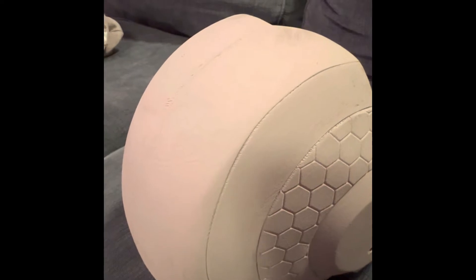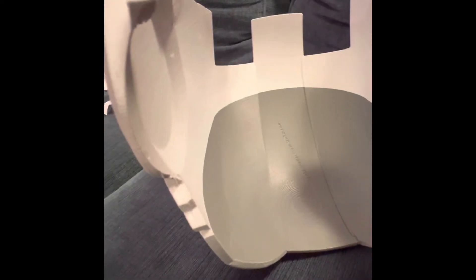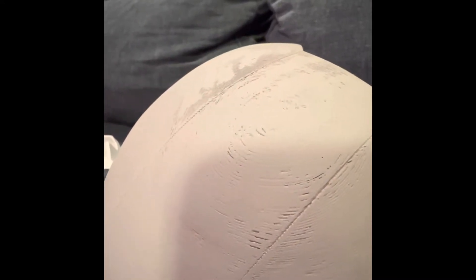So as of now, I haven't actually made a whole lot of progress. I have the dome printed right now — the top of the head. I've started the process of sanding and priming it, but you can see I have a lot, a lot of layer lines left. That's because I printed it upside down, so all those supports did not make it look very good. So I'm using some wood filler to fill up those gaps, then sanding, priming, wood filler, sanding, priming all over again. And I've got some scrapes, some little bumps and imperfections.